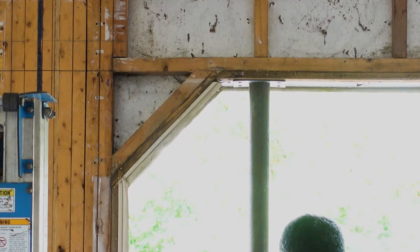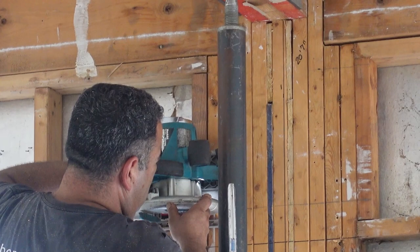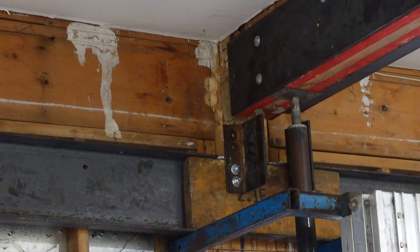while the trim was removed, and the studs in the door divider were pre-cut. The header beam was outfitted with a piece of 2x10 board and some angle iron. Everything will be drilled and bolted so the two beams meet securely and there's no chance of shifting in any direction.